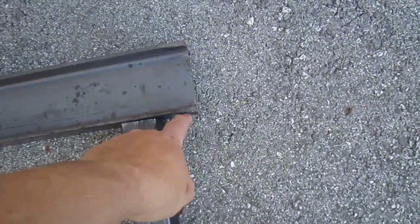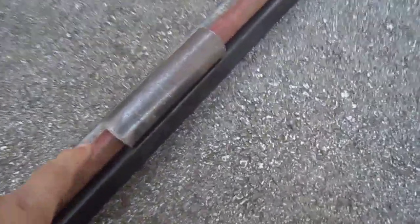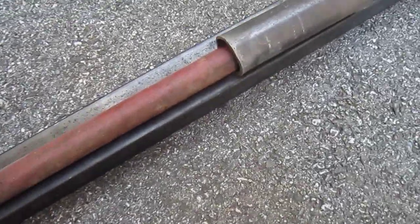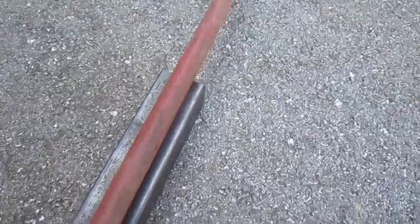The door is 250. The reason I've got these little overhangs here is not to put a gusset in them but to actually put a steel bar. This is just a mock up — there will be a bar down the side of it which will fit something like this if you can imagine. The tolerance is too much on this tube. Basically a tube will be welded to the side of the frame and then as you winch it up this will be guided as it goes up, extending with the bar going into the box section — the main square.